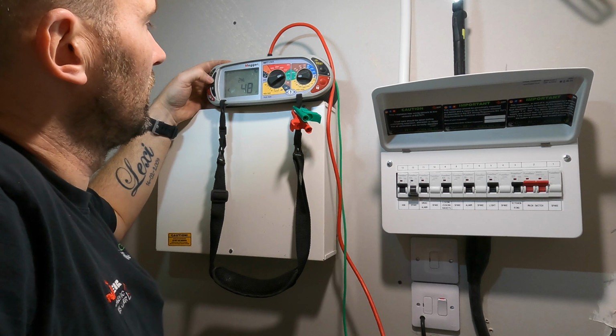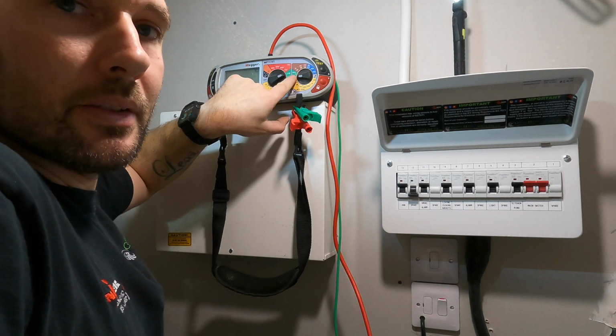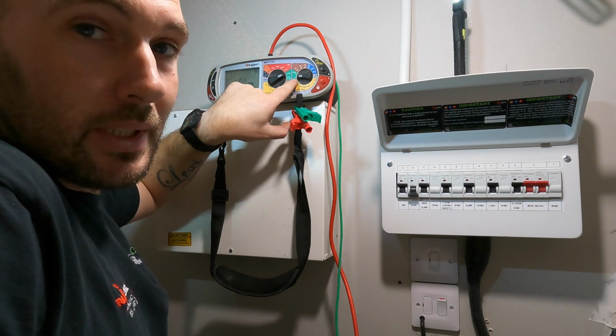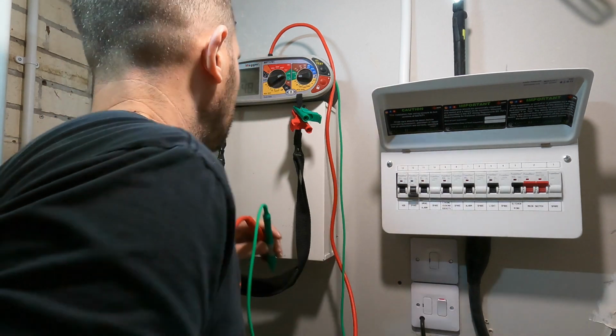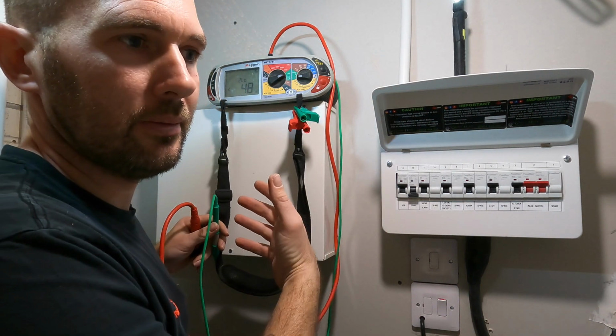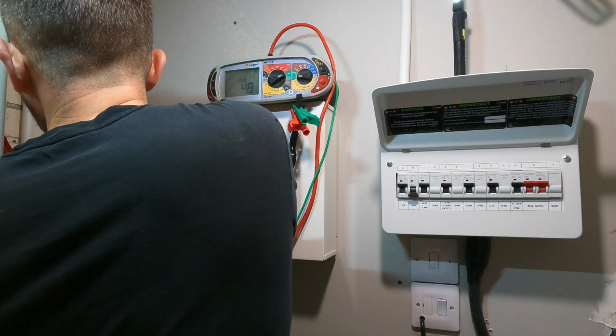We don't want a 2-lead high, we want a 2-lead low. We don't want max ZS because that's what you use for your ZE. You want a Z reading. So we need to make sure of that, which is why I don't like doing so much of it this way. I like to calculate my ZS's, but we will do it nonetheless.